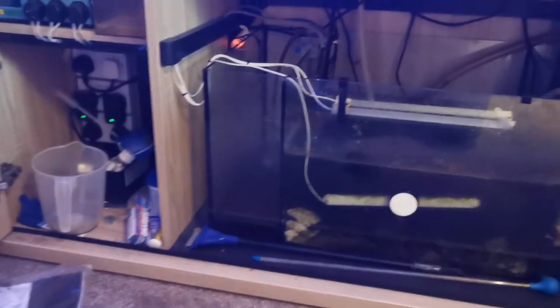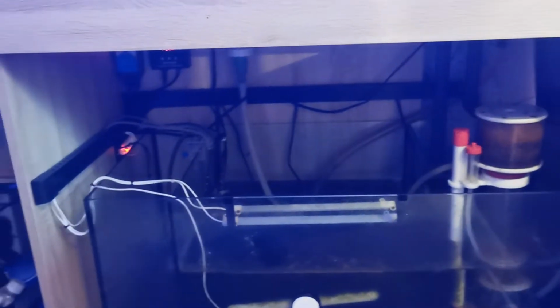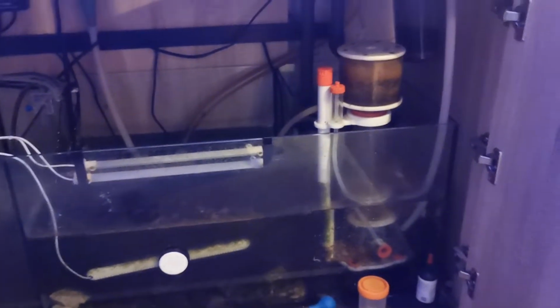Now what that will do is, if there's any current leaking down to earth, so quite often the easiest route to earth would be through you, if there was something broken in your tank, as soon as it detects any current leaking down, it will trip. Now the amount of current is very, very minimal, so it trips. Now most houses have RCDs built into their ring mains. The only problem is the further away you get from it, the longer it takes to trip.